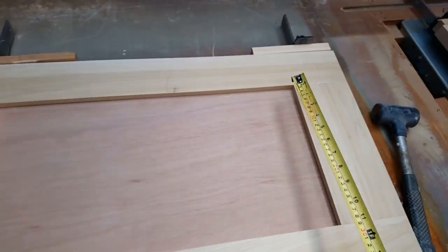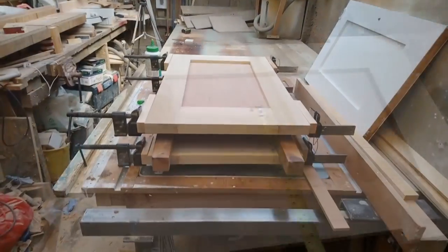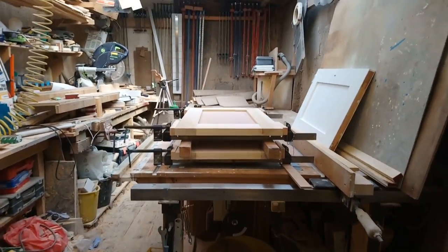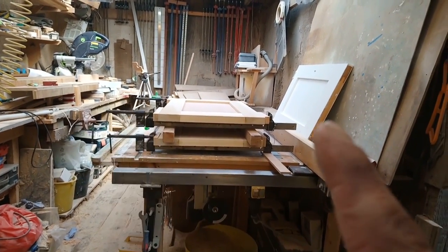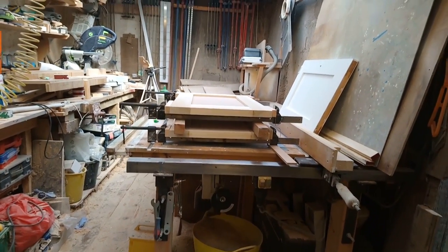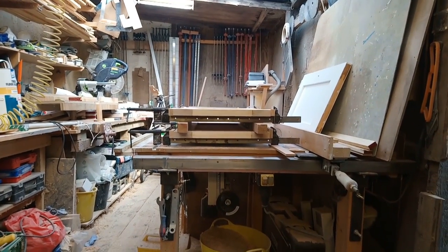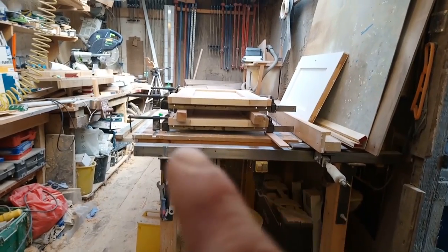But all these joints are cut square, and that's why I bought an expensive machine — because I want consistent square cuts; it makes life easier in the end. When you stack them, you need to sight through the front edge and the back edge. You can put sticks on top called winding sticks — it'll help you see that. For whatever reason, I need to put that packer under there to make them parallel.